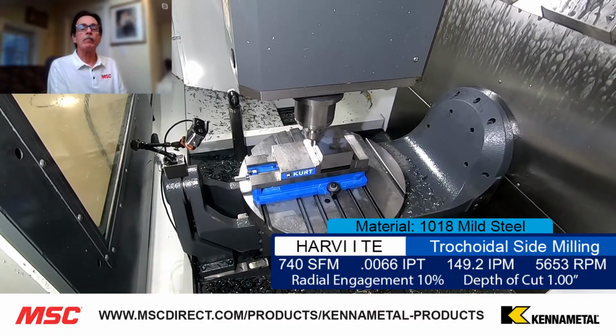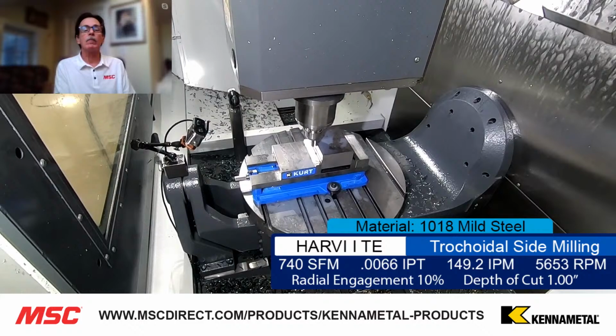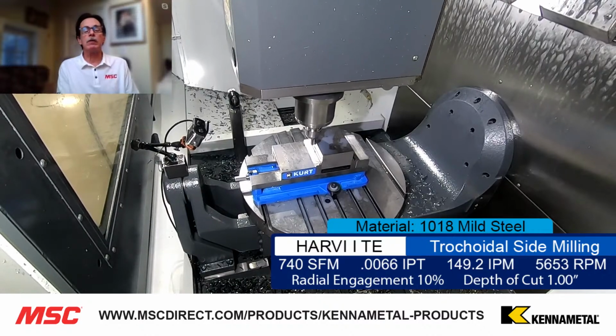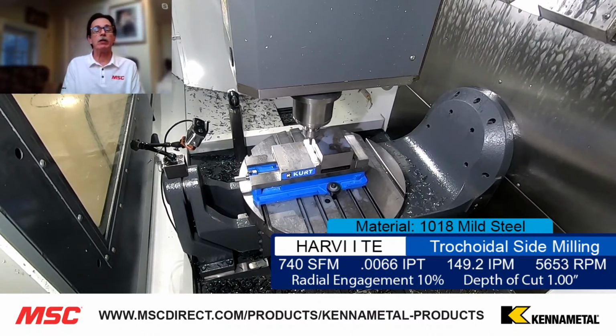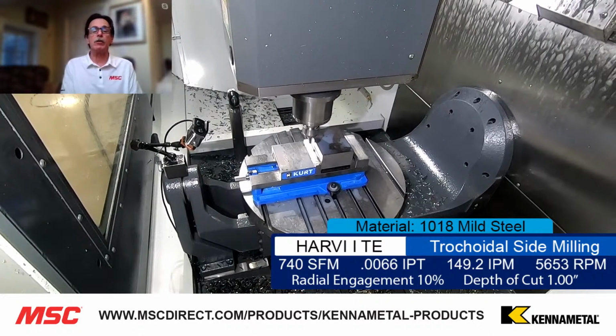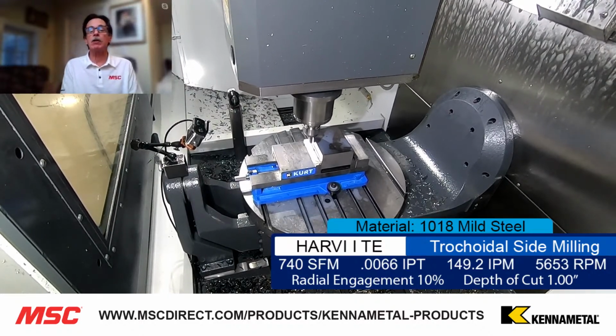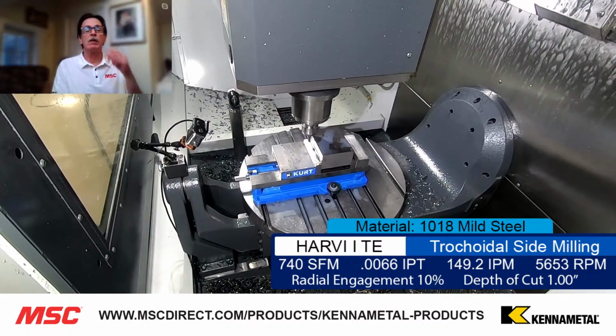Now I know with the Harvi I TE, it does have that ball nose option. So maybe what are some of the key differences between what we're seeing here and that ball nose option? Well, the ball nose has some real tricks in it too that are different to the industry, and it has this ripple relief behind the ball. It also has the facets in the base.